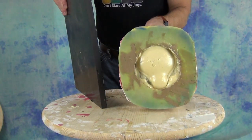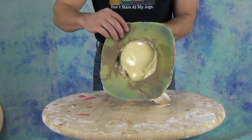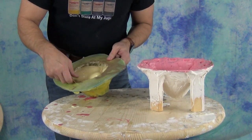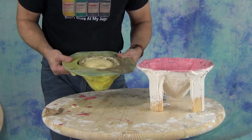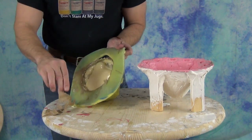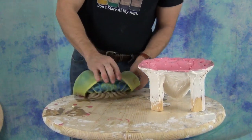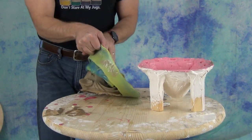This particular foam sets in about 30 to 45 minutes, and by that point the resin should definitely be set too. I usually demold a part like this within about 45 minutes to an hour. Because of the wax on that plastic board, you should easily be able to release and separate the part from it. You'll notice we filled up the mold just shy of the top — if on the next one we want it to come all the way up, we go back to our notes: if we mixed a four-ounce batch for the foam, we could raise that to a five-ounce batch, two and a half ounces of A and two and a half ounces of B. Keeping track of what you put into the mold lets you adjust and get your ratios perfect.